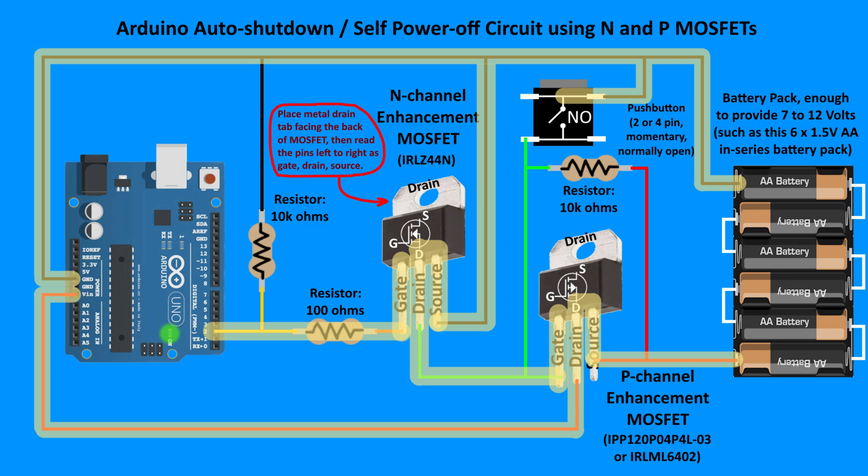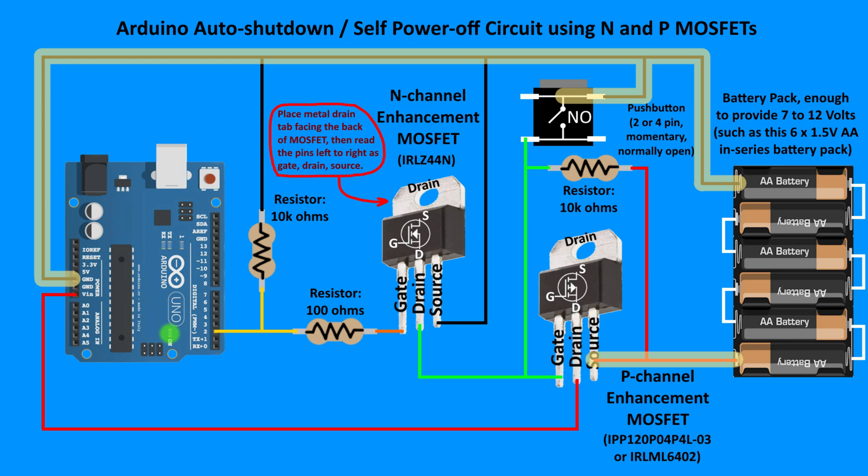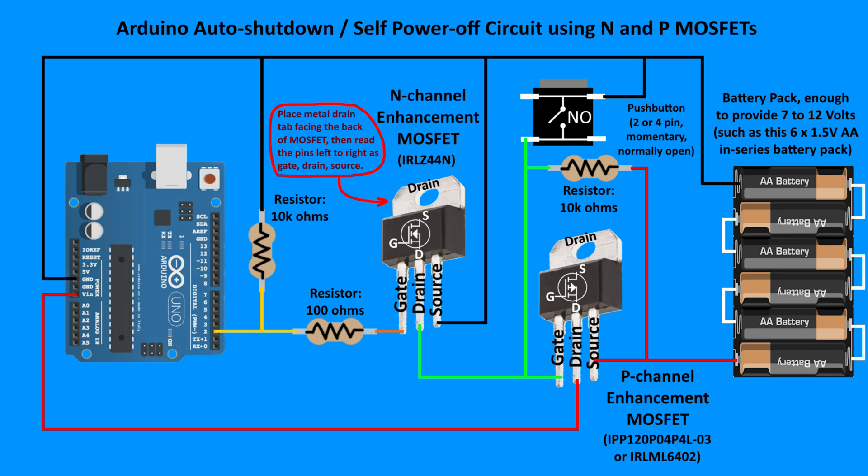All it has to do is stop releasing a voltage on digital pin 2. Whenever this happens, the gate side of the N-MOSFET will no longer be held at a positive voltage from the Arduino. MOSFET gates have the ability to store a charge, much like a capacitor, and leave the source partially flowing to the drain. However, we have a 10k ohm gate-to-source resistor, which allows the positive charge in the gate to discharge to the negative power terminal. Because the gate is no longer positive compared to the source, the drain stops flowing to the source. This now causes the gate of the P-channel MOSFET to no longer be held at a negative voltage. Like the gate of the N-channel MOSFET, any static charge can go through a 10k ohm gate-to-source resistor. When this happens, the gate of our P-MOSFET will no longer be held at a negative voltage compared to its source, and its source will stop flowing through its drain. Now the loop to our Arduino is broken and it will successfully turn off. And we're back to our original starting condition, where we can press the button and start the process all over again.